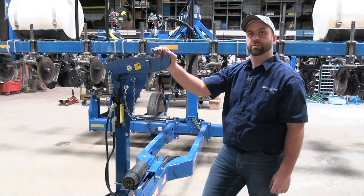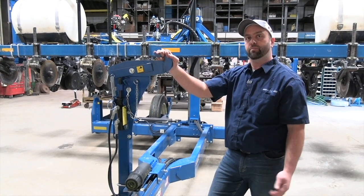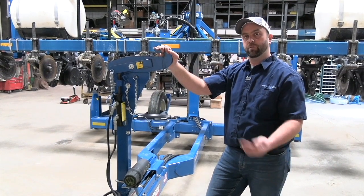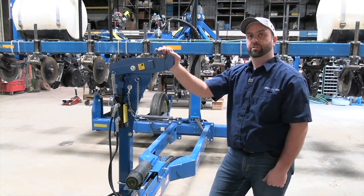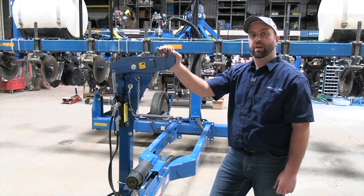Another thing to keep in mind when we're talking about wiring and hoses is that some of the newer builds we do, the more elaborate builds, we get more hydraulics, more electrical. In some cases, we're putting hydraulically driven alternators on these things because we're overpowering the amperage the tractor can provide. The more wiring we get, the more connectors we get, the more diligent we've got to be. Also, when we're speaking of alternators, some of those pieces may have a battery.